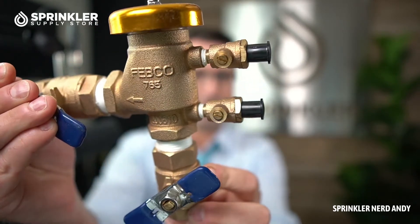One thing to keep in mind with backflow preventers is that typically these are regulated by your local code — not only the model, but also the size. This one actually came back on return from Texas because the customer ordered a three-quarter inch and then found out that his local code was regulating a one-inch size. We didn't even realize that size was regulated, but apparently that can be. So keep that in mind.